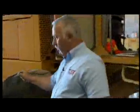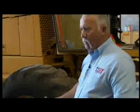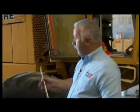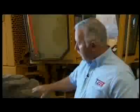The next thing we're going to look at is tire pressure. Make sure you check your tire pressure using tire gauges designed for this — they're a bit bigger than what we carry in regular automobiles. Find out the required tire pressure by following the manufacturer's recommendations — both from your equipment manufacturer and the tire manufacturer. An under-inflated tire is a serious problem. If you under-inflate it, you will get over-flexing of the sidewalls, which when the machine is under load can create extreme heat and possible tire failure while rolling down the highway.